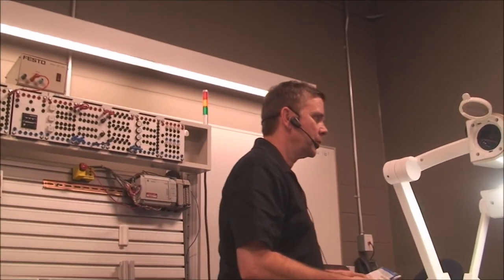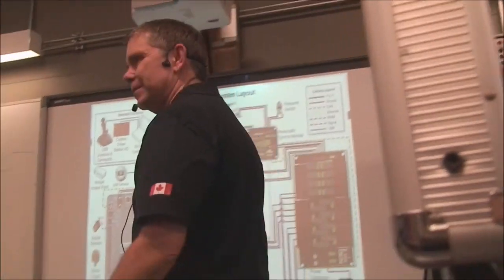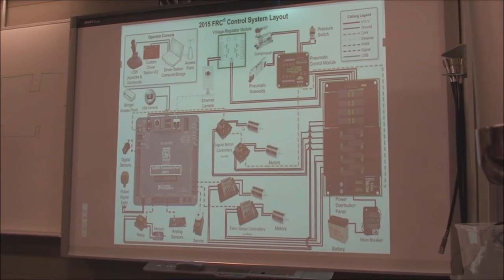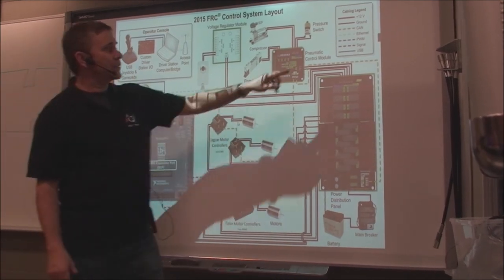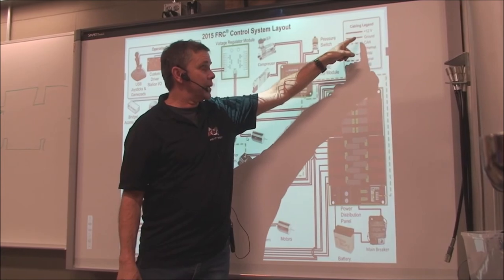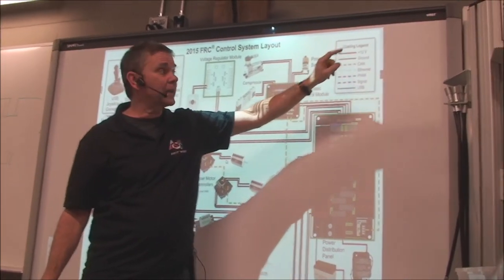Okay. Thanks, Logan. Now, how do you put it all together? This is the overall wiring of the FRC system layout, which exists all over the internet right now. All the different connections are laid out by this cabling legend up in the corner. So, big red and big black is the power, the main 12 volts, the ground. The system all runs on 12 volt supplies, of course.